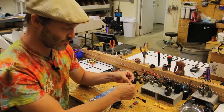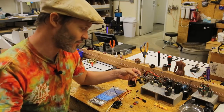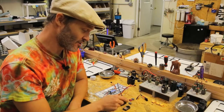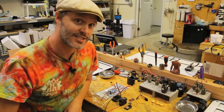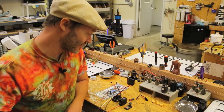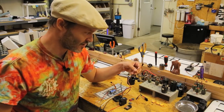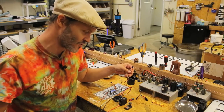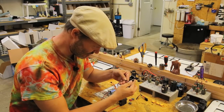What we have to do is either remove the red wire so that both aren't powering the radio directly, or we use what we call a bypass adapter. So we have our servo, our radio, and our ESC. Today's ESCs have an internal BEC already built in, so we don't need an external pack to power our radio — it'll shove out around six volts depending on the ESC, and that powers your radio, going into channel two as normal.